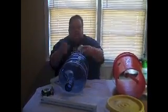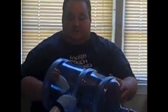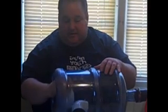I took a 45-degree coupling and cut it off even, because that gives me more space there than a 90-degree would. So when the water comes in here and circles, the waste falls down at the bottom, and this is where the water is going to drain into my other biofilter that I'm building. This outlet would go right dead in the center of this.